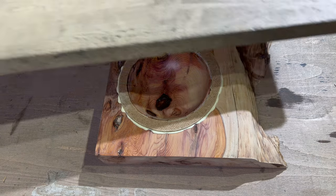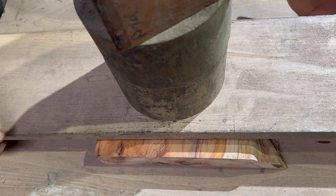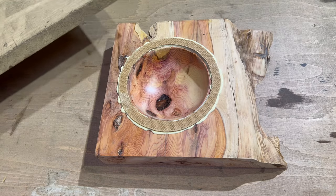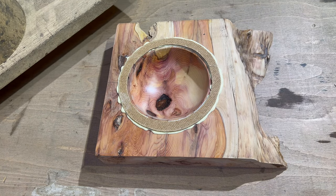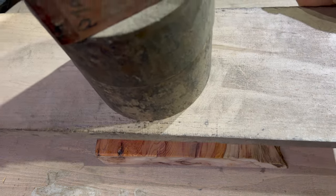A little line of glue around the outside edge, because I don't want the glue spurging in the bowl either. And I just want quite a lot of weight on there — a couple of lignum blanks because they're nice and heavy. Quick look, make sure the glue's not splurging into the middle — it's not, it's close, but it's not. That'll do nicely.